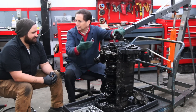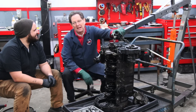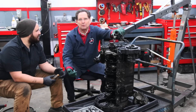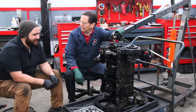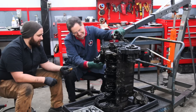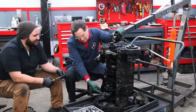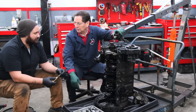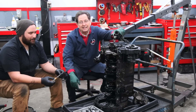We're looking for the gunsmith that built the smoking gun. We said we were not going to pull this pan off, but we both got out here this morning and said we've got to pull the pan off. How long did it take us to get that pan off? Over an hour with both of us working on it. Because nothing goes smoothly — there's always something that's over-torqued. This one had been in before, so there's stuff that's over-tightened, rounded out, hard to access, even with it outside of the car. We got a lot of silicone right here, so the engine has been opened up before and it's been overheated. All those bolts are really tight. We had to use every trick in the book: chisels, heat, hammering the heads of the bolts. That's why it took so long.